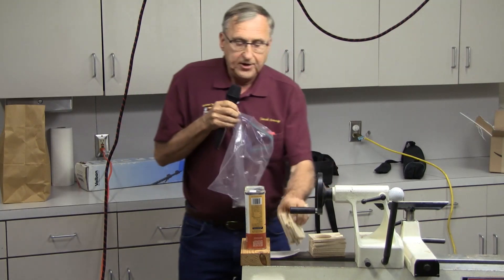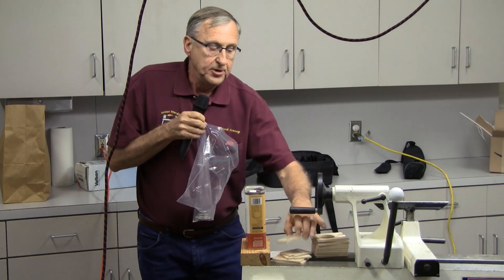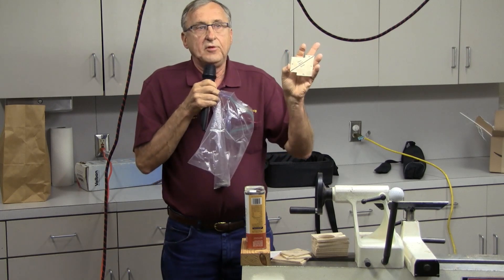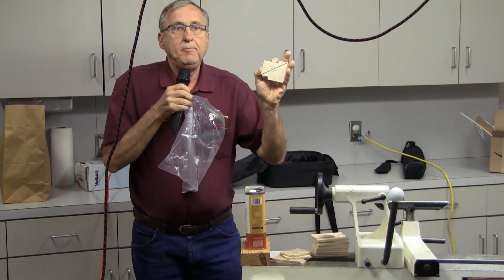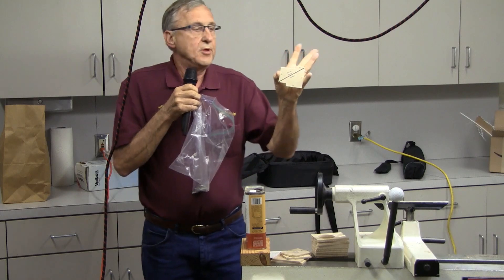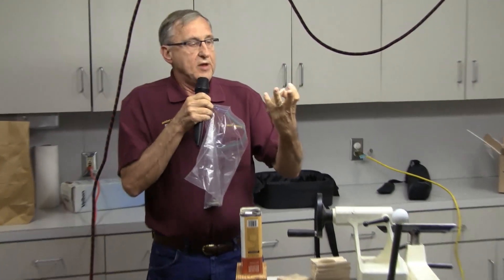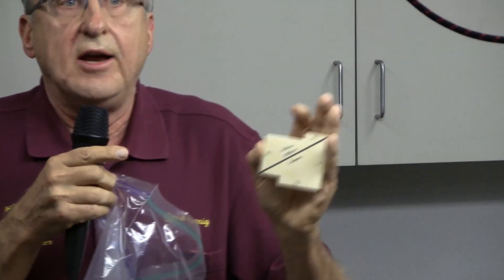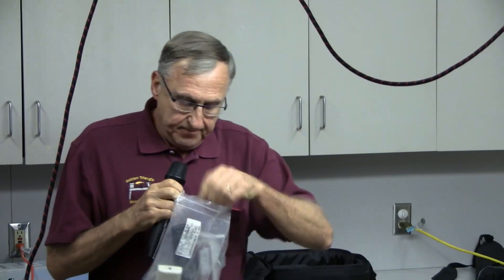As for the actual size, I've got multiple jaws like most of you. I did mine a little differently — one side for the spigot and one side for the recess — and I put the maximum and minimum for each of those on there, so it's got four different dimensions. If I'm doing a spigot it's got to be somewhere between this and this. It's not precise, it just has to fit the jaw.